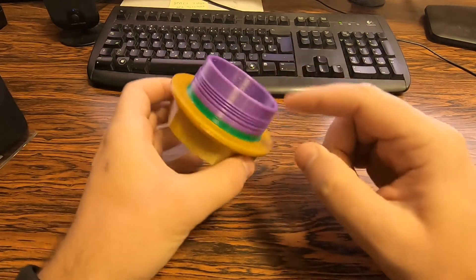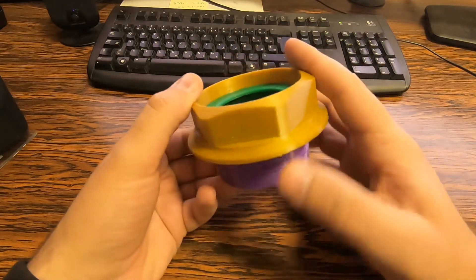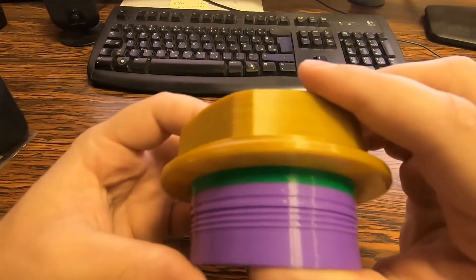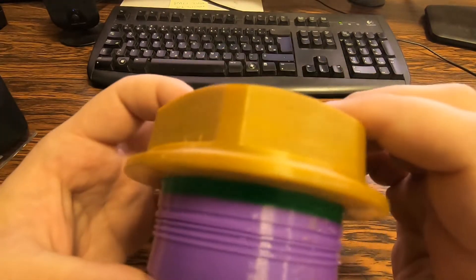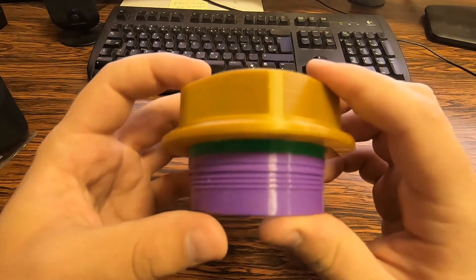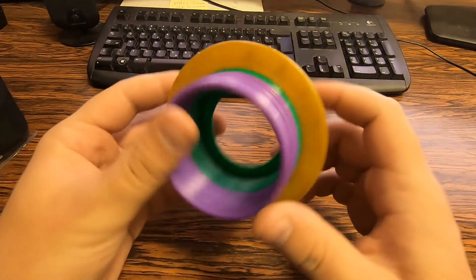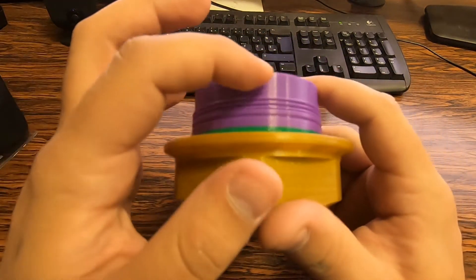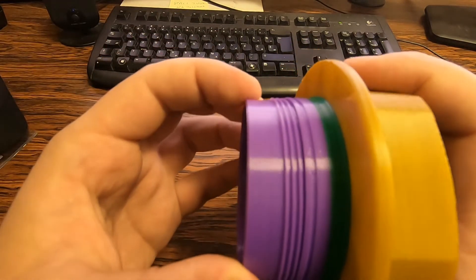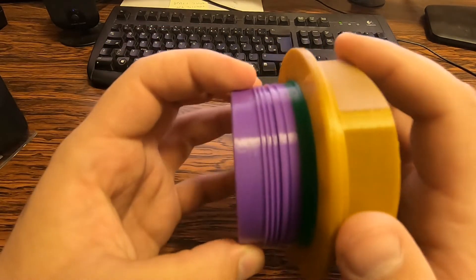I have run out of filament here and so it is three colored. You can see the texture. This is a 0.8mm nozzle and the layer height is 0.3 on this part and 0.2 on this part, so you can see it has a finer layer height.